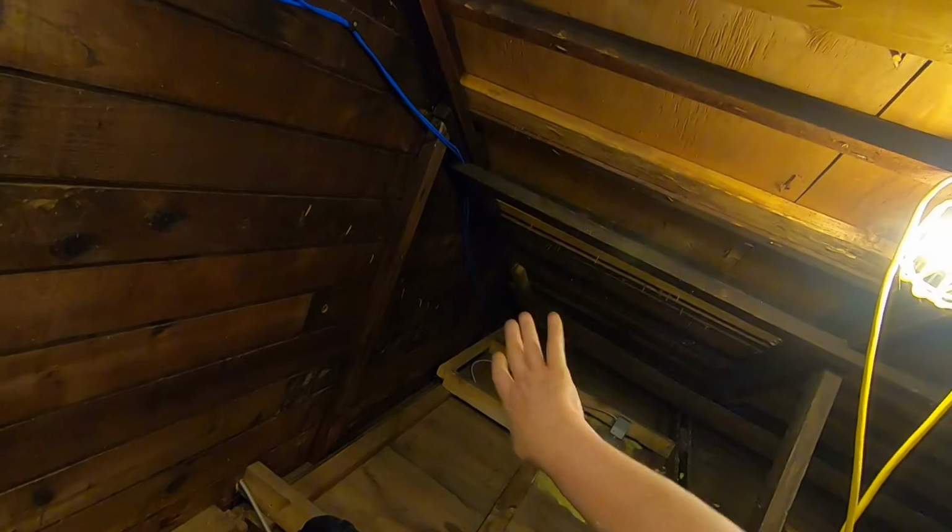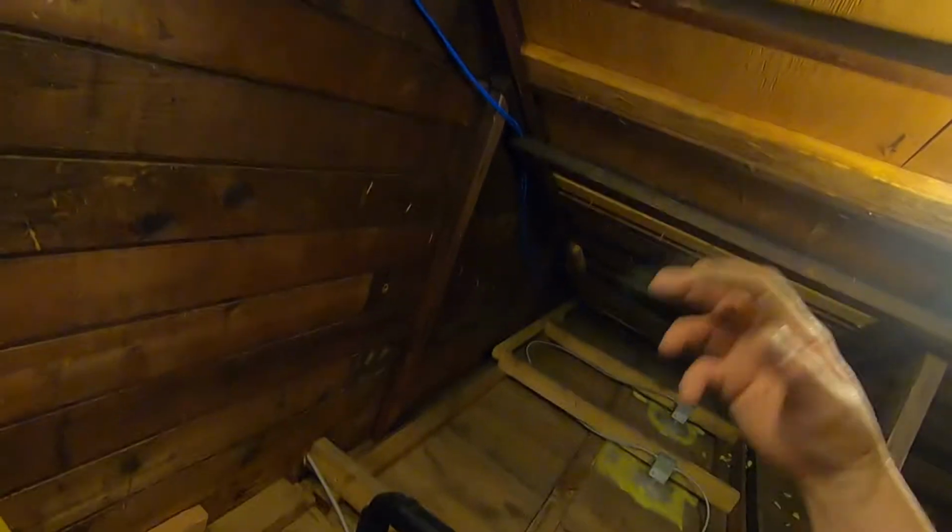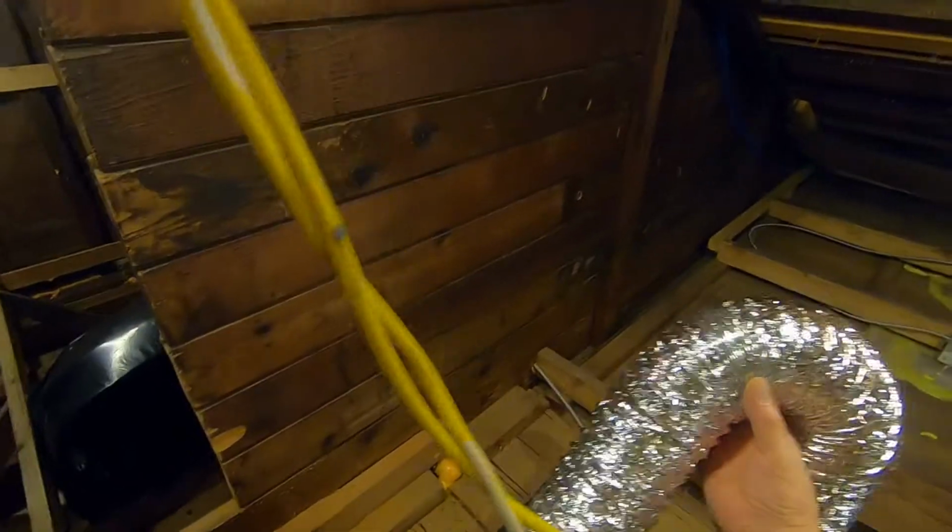A bad way to do it is to put it down in the eave of the house, because oftentimes if you put it down low like that, it'll vent out, but then the updraft that you've got naturally circulating through the attic will pull that warm, moist air from the shower vent back up into the attic. And you can often see that. You can look on YouTube, and you can look for instances on Google, where you can see pictures where the attic is all moldy because that moist air is being trapped in here. The other thing is some people just think that venting this somewhere into the attic is sufficient. It isn't. You've got to move that air out of the house.